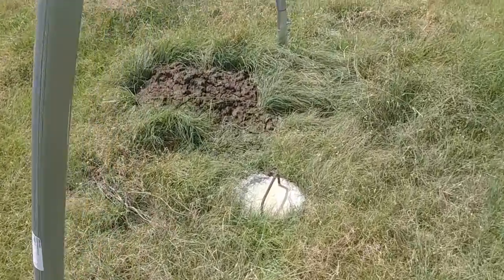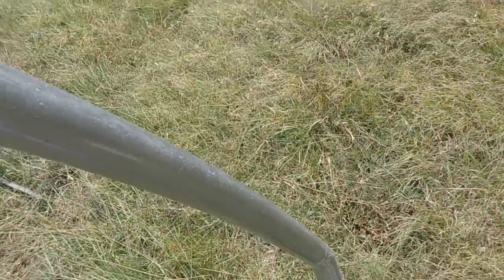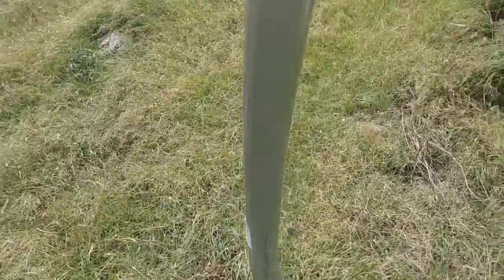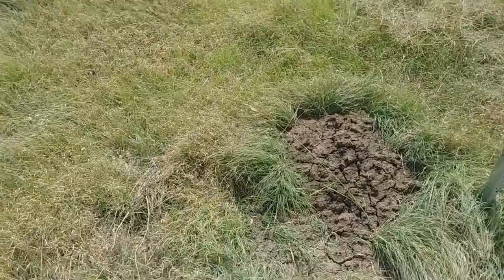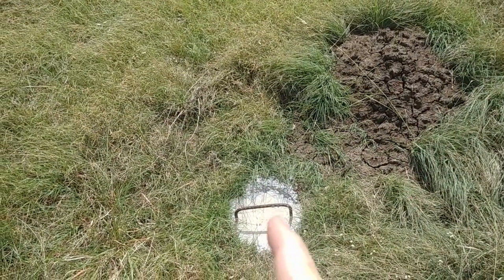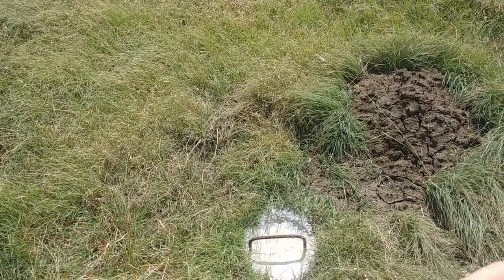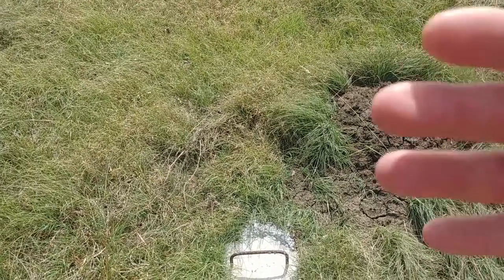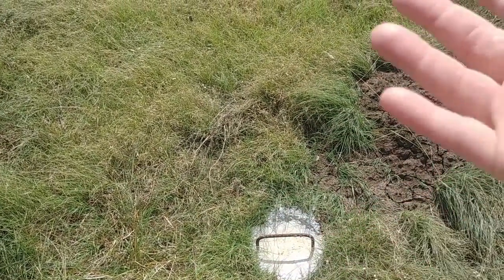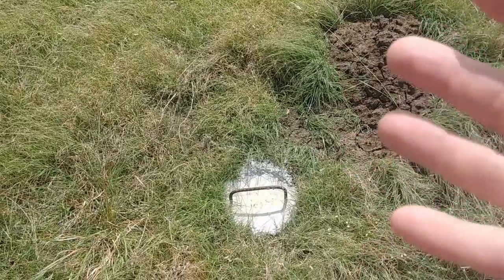What we wanted to do — if you look down the side of the tunnel — our tie-downs are inside of the tunnel so they don't interfere with the curtain. The vinyl covering comes down over the top of your arches and works its way down to the ground so you can roll it up and down. We set the ring in the center of these posts, and our intention is to take a guy wire from that post to there and from that post to there. Because it's inside the tunnel, we're actually pulling pressure inward to hold the infrastructure in the ground. If wind gets up underneath it, it may rip the vinyl off, but the infrastructure — the actual poles — should be anchored right there.